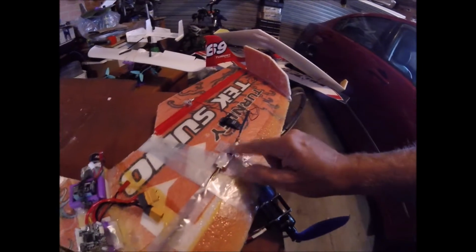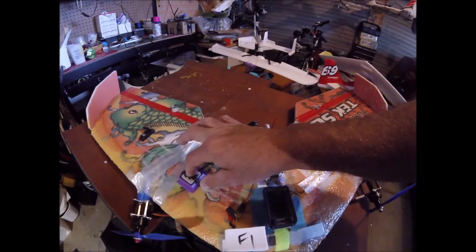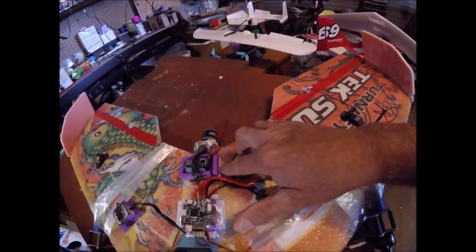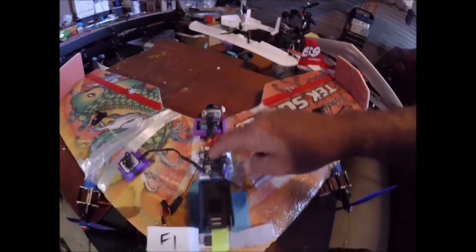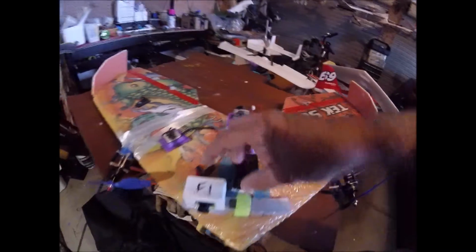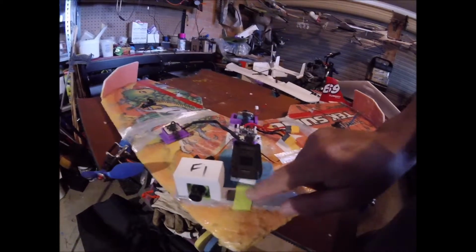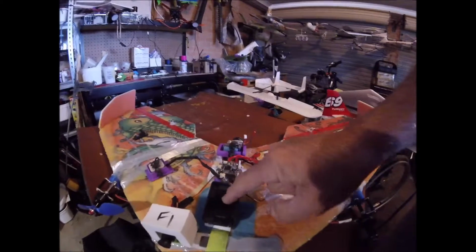FPV transmitter on out here, because we're going to be running GPS out this side. So I've made up this little battery holder and just glued it on with some foam. It sits there with a rat strap. We've got the Omnibus F4 running iNav. We've got the FPV camera here sitting offset. We've got a spar through here to give it extra support for the battery. There's the battery strap, so the battery's underneath. We've got room here for the Mobius on the front.